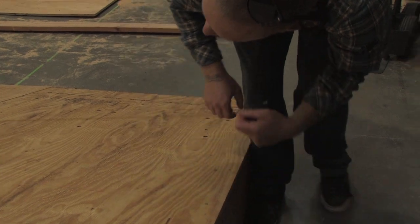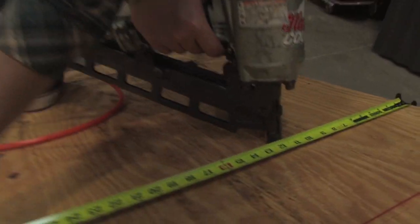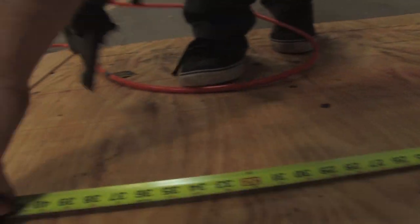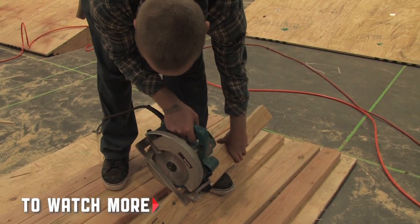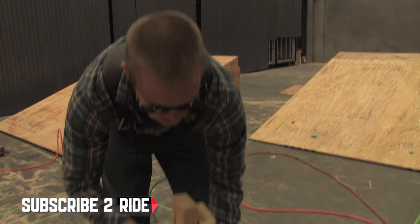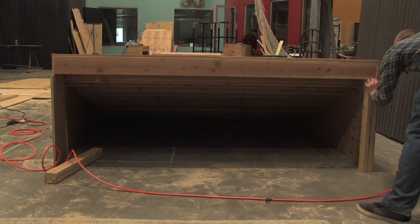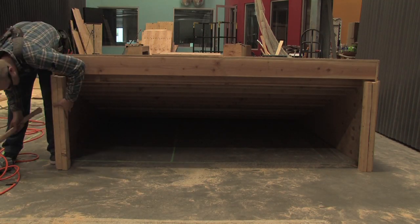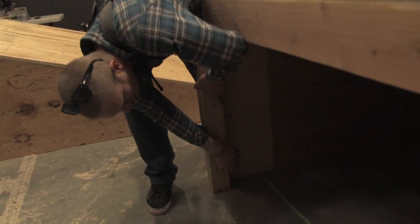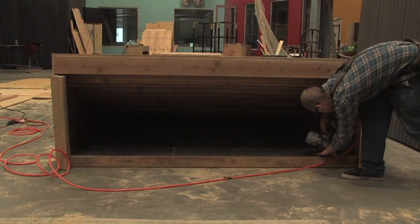Right now what we're going to do is chalk off the entire ramp on all our studs, so we know where to nail. Now it's time to put our nails every eight inches on the side and every 12 inches in the middle. We nail these together — we're going to hang these off by two inches and basically these hold the ledgers. We nail the ledgers into this, then we nail a two-by-four right here at 94 and a half. It basically strengthens your bottom so it doesn't sway back and forth.